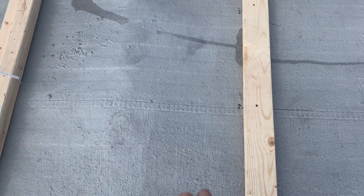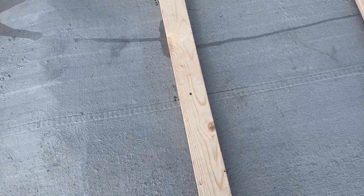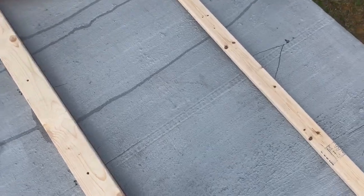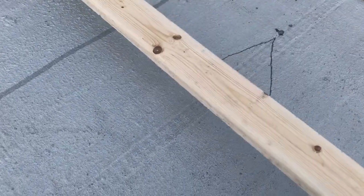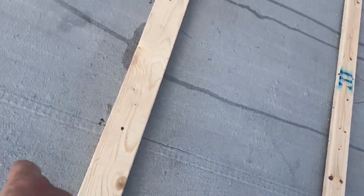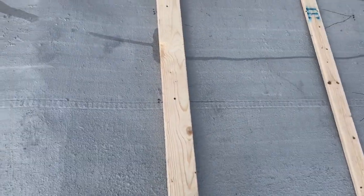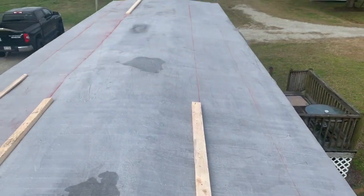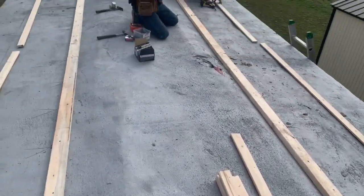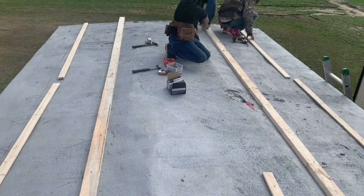The reason why is like I told you — we've got a big hump here in the middle that sticks up, so we have to level it out to the hump level and then to the edge. This might be in a different place on your roof. We're going to put it right here — screw to the outside, screw to here, screw to here, screw to there. There are plenty of places to screw to. So strap your roof up if you have a big hump in the middle like we do — not all of them have this; it's kind of unusual.